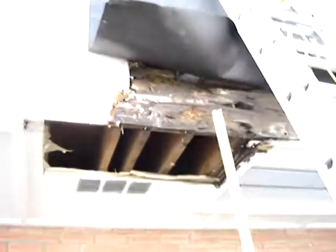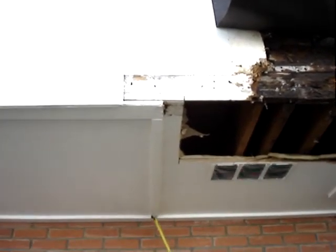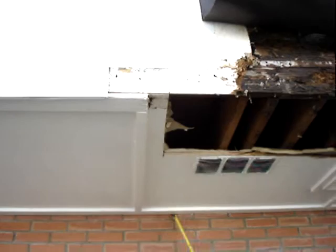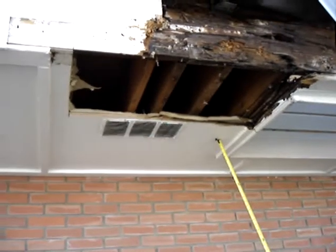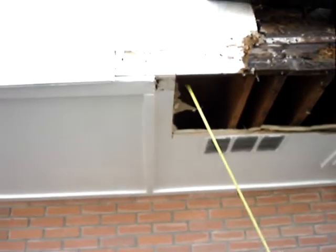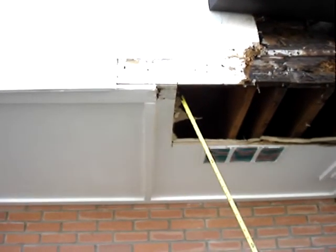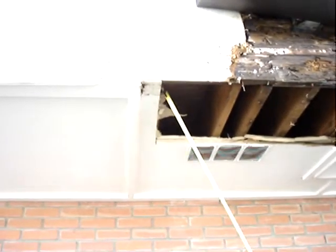The job flow is we're going to have to take off this rough sawn half-inch plywood. I would take it off here behind this trim, demo this piece of trim to expose the cantilever joists. I'm pretty sure the joists aren't bad because the ends aren't bad. There is also some 5/8 type X drywall for a fire barrier that will need to be replaced.